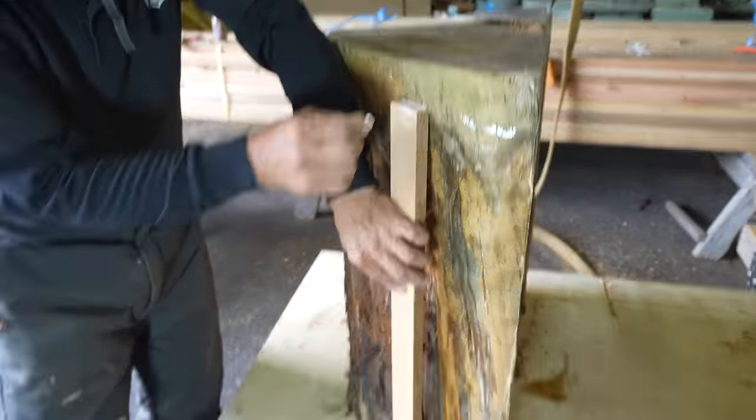I planed the inner notched part with an electric plane as well. You can plane various places with an electric plane. It is a very useful tool. Only concave surfaces, such as warped wood, cannot be planed, but the convex surfaces can. An adze works well on this part. All tools are useful. Finally, I used tsukinomi to finish it.